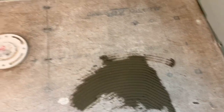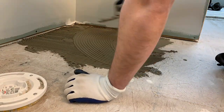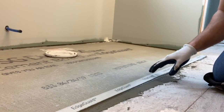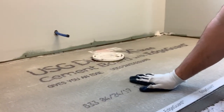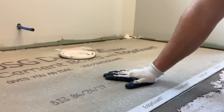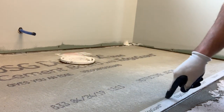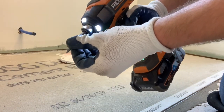I just do one sheet at a time — I'll go through and do this area for the first sheet, then put it down and go to the next. Once everything was cut, it only took me about 30 minutes to lay all the cement board on the floor. After you put the thinset on the floor, you set your pre-cut cement board. Then go through about every eight inches or so and put a screw down the seam, and then every eight inches across the whole thing.